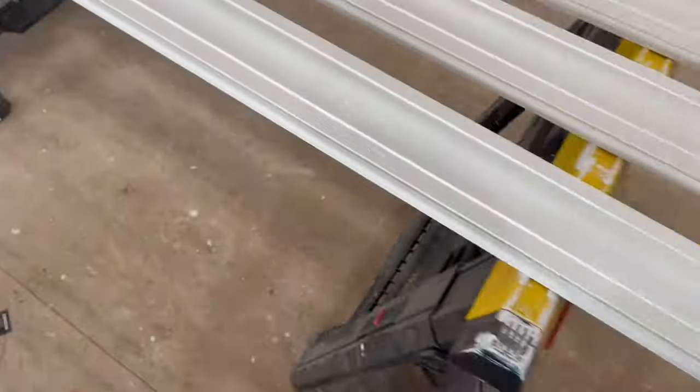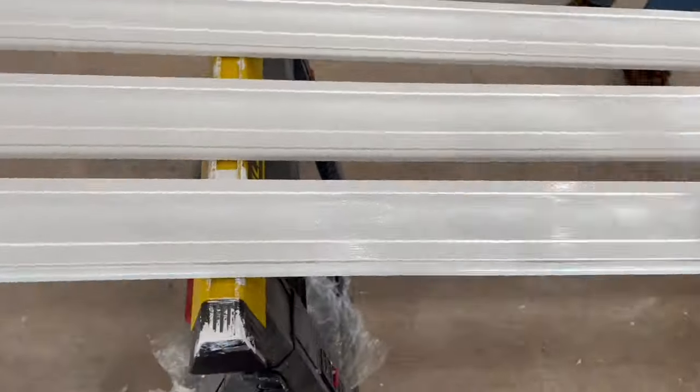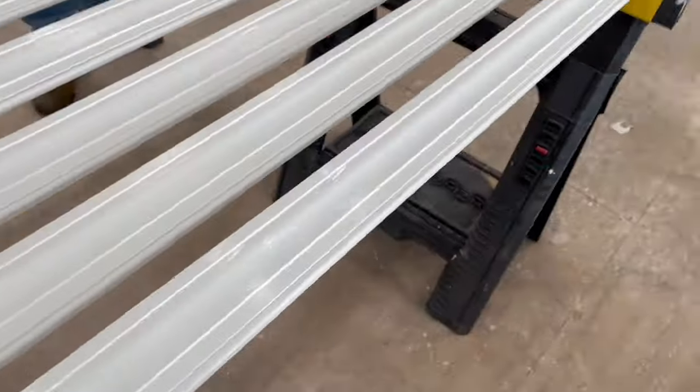After I apply the paint using a roller, I go back through with a brush so the paint gets evened out and down into the creases of the trim. You can also spray the trim if you don't want to use a brush and roller, but the sprayer is extra cost and it was cold out on this day so I couldn't spray outside. I placed paper over the window so we can film in here — otherwise the whole screen would be blacked out.